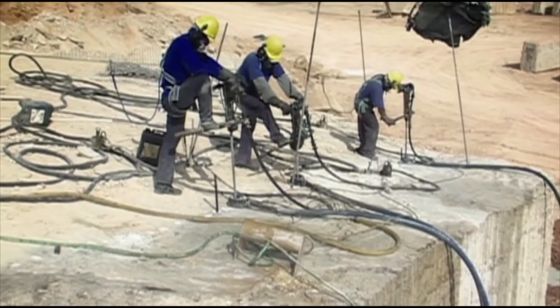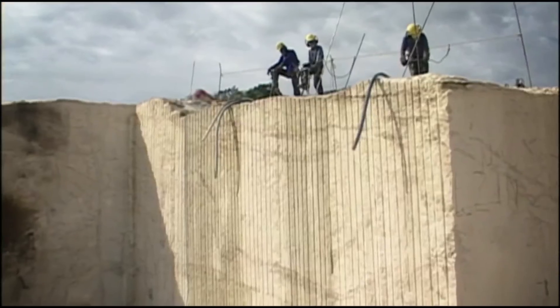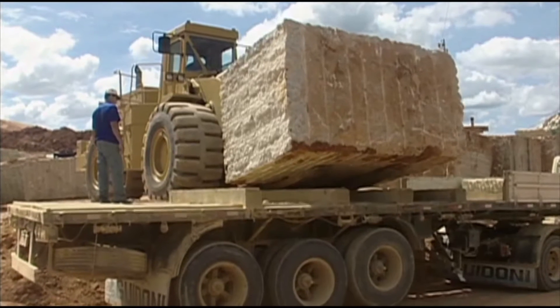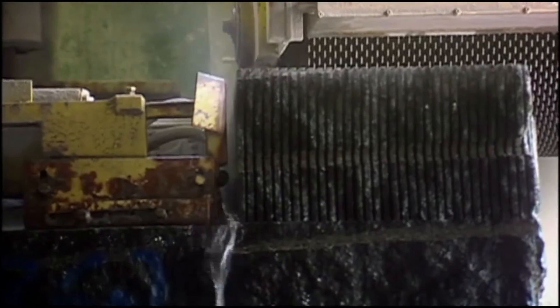The first thing they do is jackhammer drilling to establish a bench. They'll lower the bench and from it create blocks that are transportable on a truck. Once those blocks are transferred to the factory, they start processing slabs under a gang saw or tiles under a block saw.